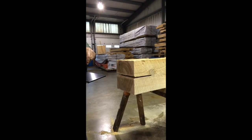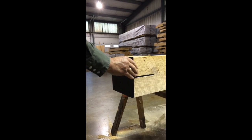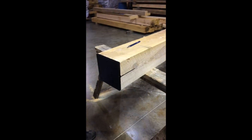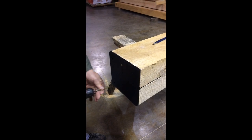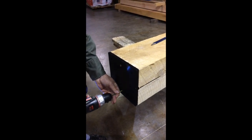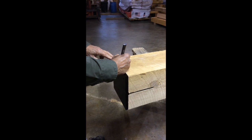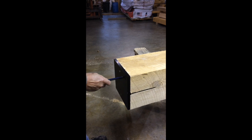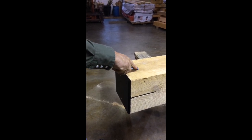The next step in this process is to insert the T-Rex and center it on the beam. We put two screws in here to hold it where we want it during drilling. It's very important that we put a witness mark — just a little pencil line — on the T-Rex and on the beam. This T-Rex is going to stay with this beam until it is assembled.